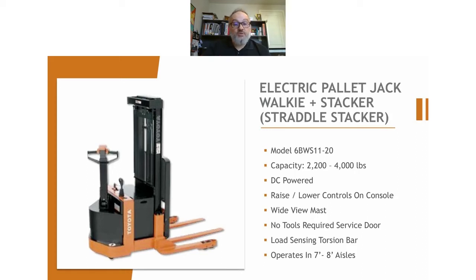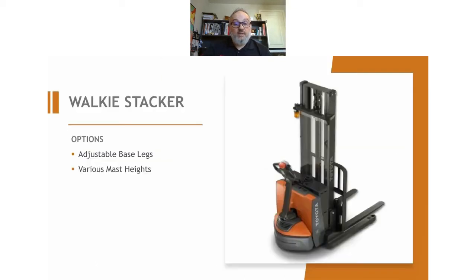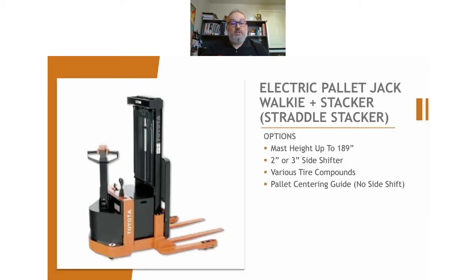You can get industrial batteries for this one as well, so you're looking at longer run times. Going back to this machine — you want to make sure that we're ordering maintenance-free batteries for you because there's no way to get in and swing the six-volt batteries out to water them since the mast is there. If you do get wet batteries, you're going to have to pull the whole pack out, and that's not something you want to do. With this machine, you're also able to get a side shifter, which on the entry-level one you cannot. So if that's important for you, it makes it a little bit easier to operate, especially in tighter aisles.